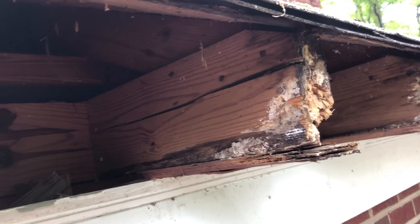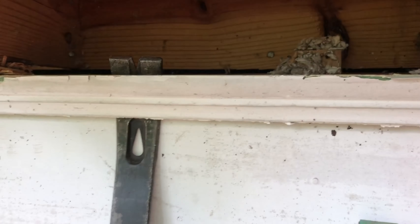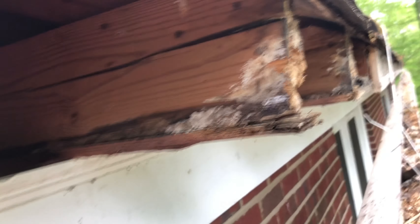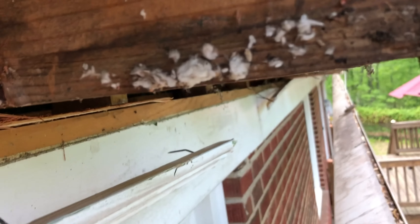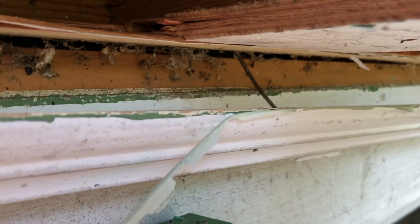To make it a bit easier, once I get the main sections of the soffit removed I've got a better angle to go ahead and pull this molding off. I'm going to get my pry bar underneath here and pull the molding off all along there so I can get the remaining pieces out that are directly underneath the roof trusses. Once that molding is dropped down I have access to these remaining pieces that can just knock down. You can see how that molding was attached in there with these long nails.